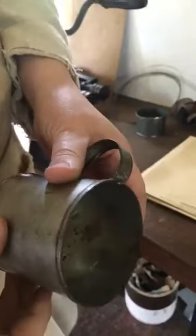Now, Todd Jackson, age 8, would like to know if the tinsmith did any welding. The tinsmith didn't do any welding. He did solder. If you want to see the welding, that's down in the blacksmith shop. What we would do here is we would do our butt joints and our edges, and you can just barely see the solder around the edge of that one. We would solder everything together.